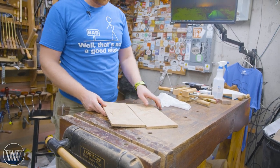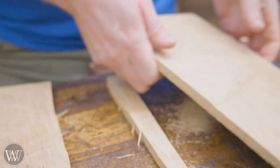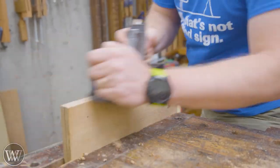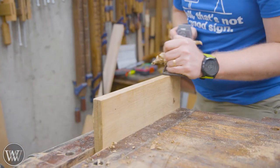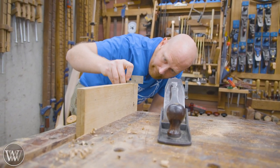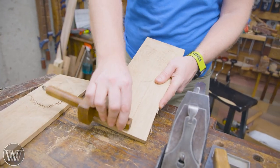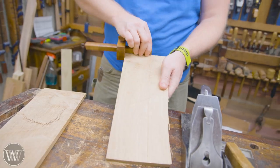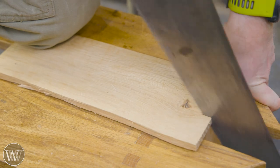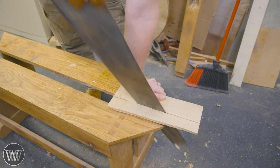This will be enough for me to get six pieces out of it. Why six and not five, because it's a pentagon? Six because I know I'm going to be breaking one or messing up the joint on one, and I'd like to have one in spare. So I'm going to joint up the edges, get them nice and true, and then rip these down to the correct width. That will end up being the height of the bowl. The width of the pieces will be about four inches. The board has a slight knot in one end — that will be my leftover piece.